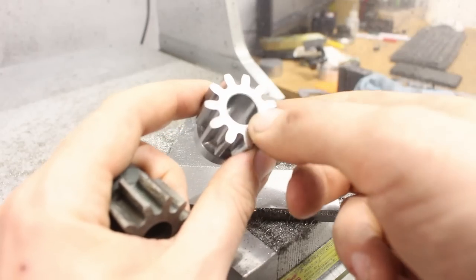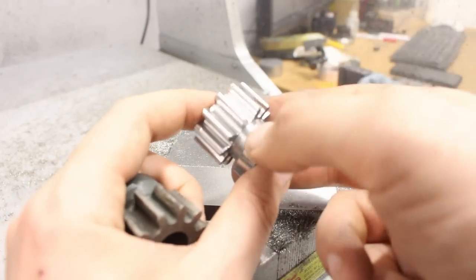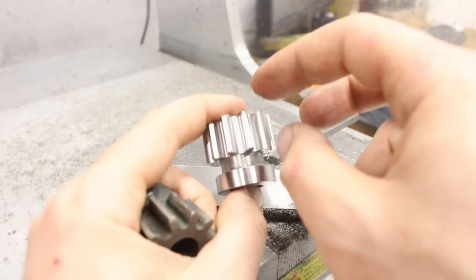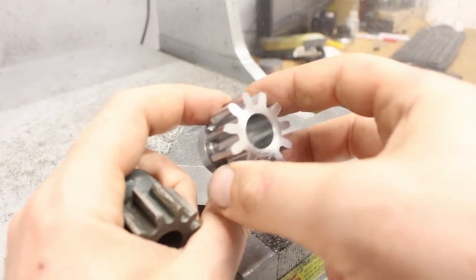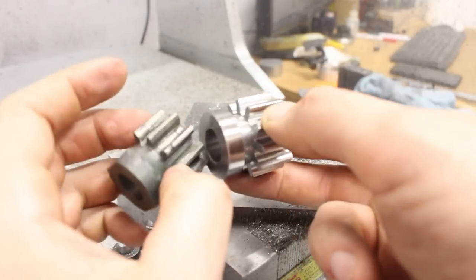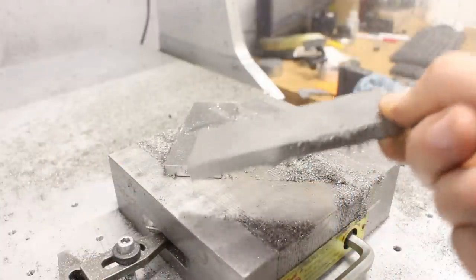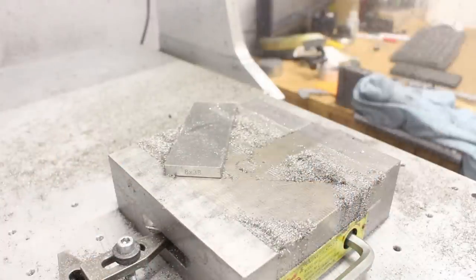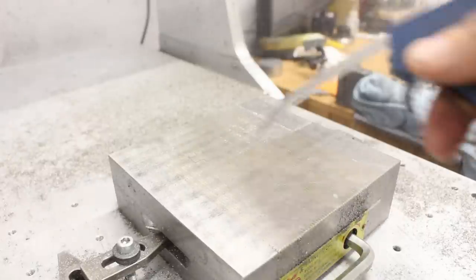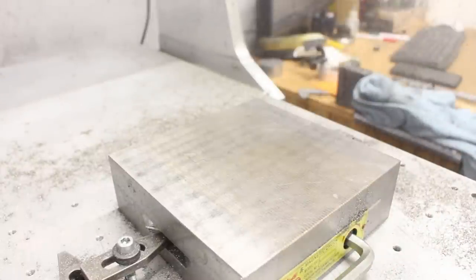They match the radius of the tool. Normally with a 45 degree or less helix angle tool, that leads to fairly catastrophic chatter on such a long necked tool. So I'm mighty impressed by this tool, to say the least. So here we go, the part comes off. The nice thing about the magnet is once you pull off everything, it cleans off very nicely.